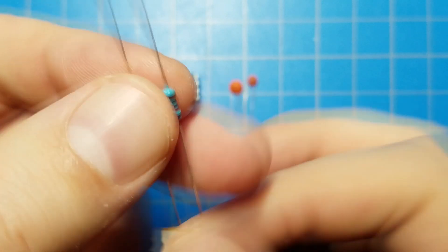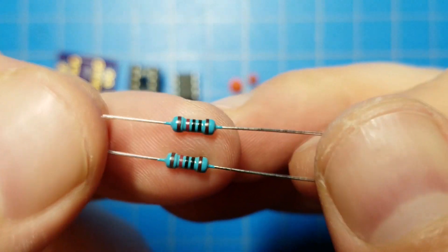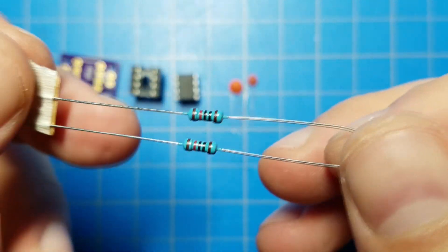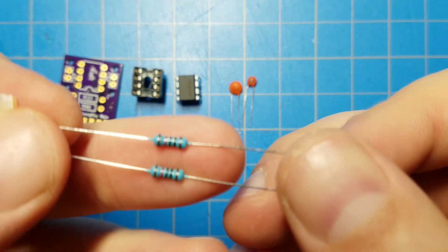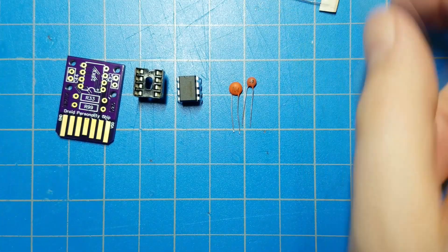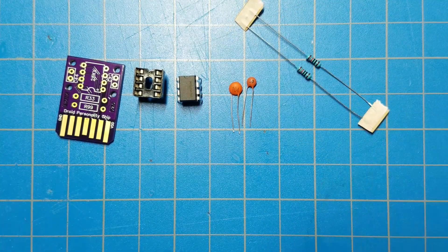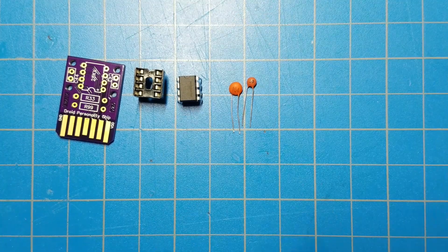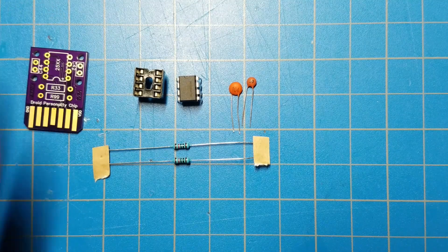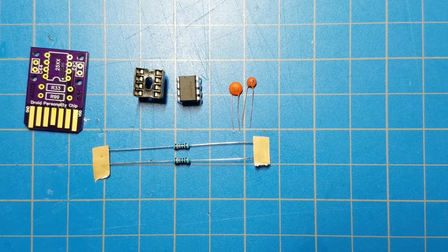The last stripe on the right is the tolerance, which is also brown, so I could totally see myself flipping it over and thinking it's 120 ohms — it's annoying. This is why for these metal film resistors I usually confirm with a multimeter before I put them into something. Okay, those are all the components I need to put this together. I will now assemble it.